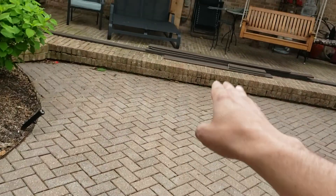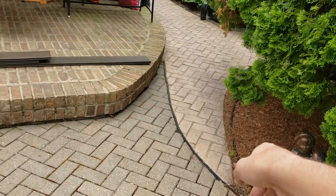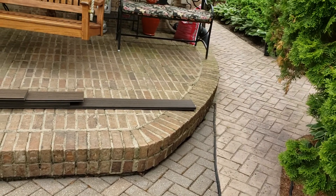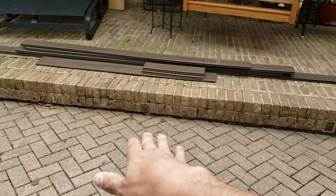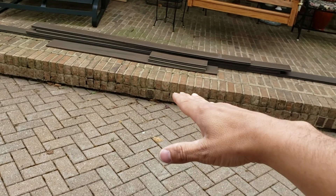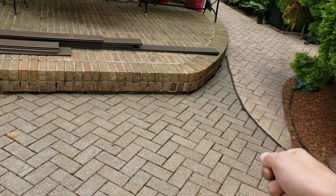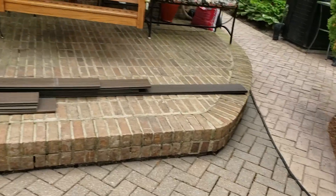We're going to be raising this probably a portion, so that makes this area sort of awkward. But if you notice, it is lower there already, so you will be able to raise this area a little bit. But if this area is raised by, let's say, a couple inches, you don't have a couple inches here. So you'll have to take your trowel and feather it in over here. That's the tricky part of the job.